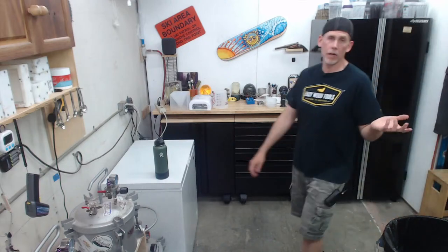So a little update on the dust collector. Everything is pretty much in, it's working fabulously. I had a few leaks right off the bat, and I ended up contacting Oneida to see if there was something they recommended. What it turned out to be is I didn't really have the pipe fully leveled out. It's kind of hard with the quick clamp thing because you can't put a level across the pipes. There's a clamp in the way. So I was eyeing it and it seemed close enough, but the truth was I needed to level out some of the pipes. So pretty much fixed all the leaks and it's awesome.